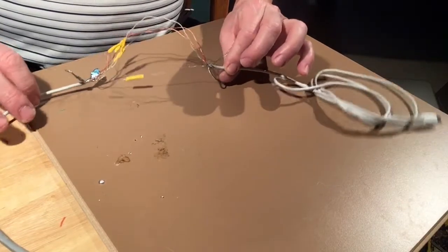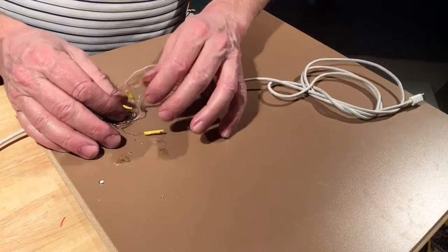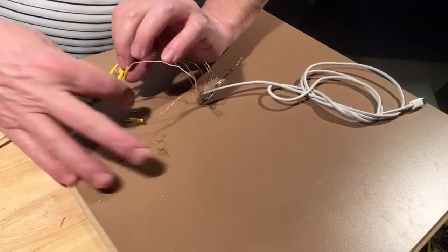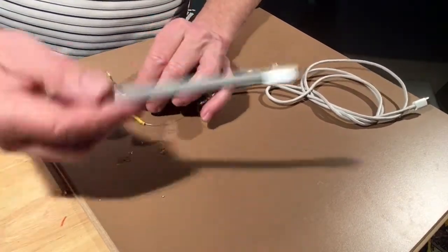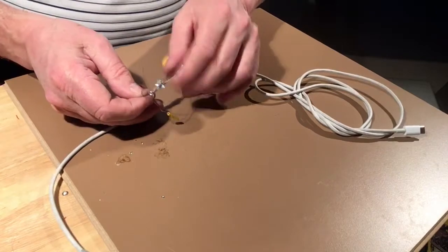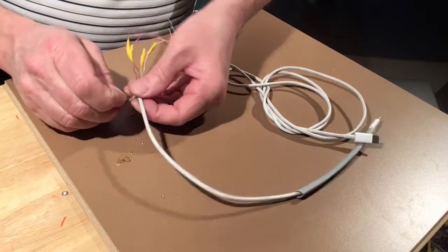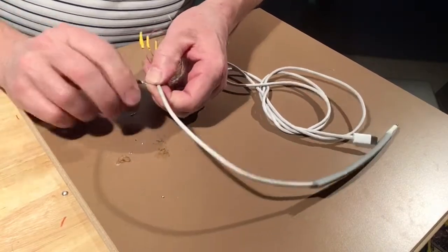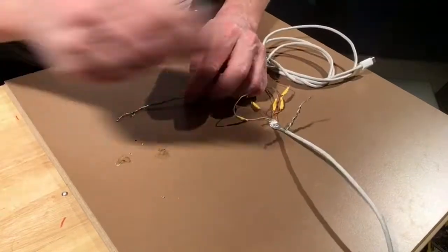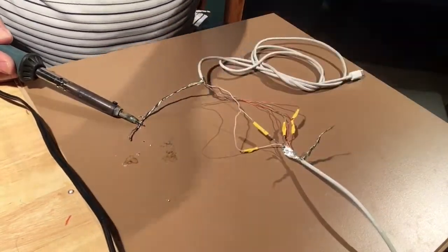And you can see that that little short wire needs me to bend this stuff out of the way. But I'm going to bend it in a way that it's not going to be too thick for my other piece to fit over. And I'm going to straighten them out. And these can be wrapped with these. Just wrap it like that and just kind of solder lock it in place.